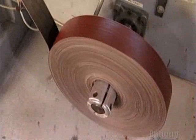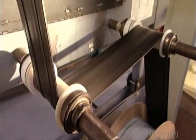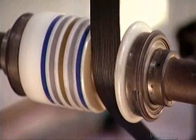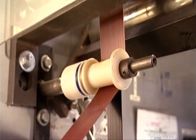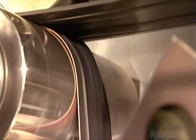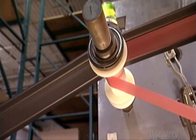Then a mechanical puller unrolls material from four different spools. There are two streams of rubberized fabric, one stream of the synthetic rubber which came out of the extruder earlier, and one of rubberized cable wiring. They merge and stick together as they travel over a big steel roller. An unwinder peels away a plastic liner from the now four-plied strip.